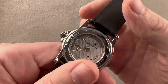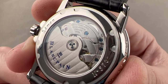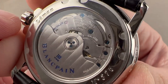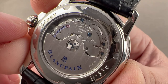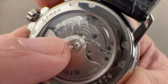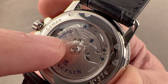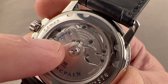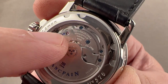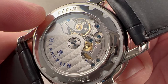Flipping it over, you can see the movement, which is made by Frédéric Piguet. It is caliber 6950, based on the Frédéric Piguet 1150. You can see two barrels. It is an automatic winder with a 72-hour power reserve, adjusted in five positions like a chronometer, and it pivots on 35 jewels. The two barrels make for a very even torque release. A single-barrel movement tends to see torque fluctuation when fully wound — running fast — and then after just 24 hours can see a big torque drop-off, manifesting as a loss of balance amplitude and slower timing. With twin barrels, you have less of that problem.